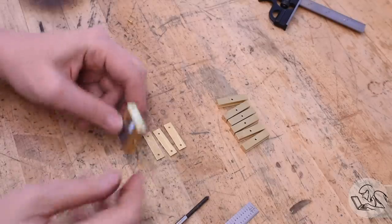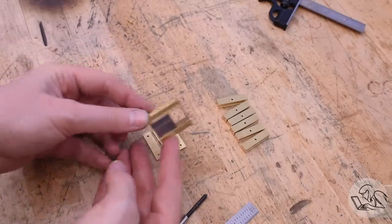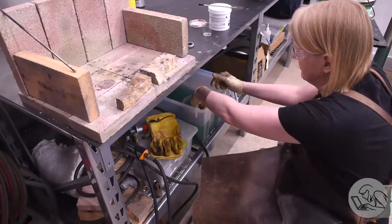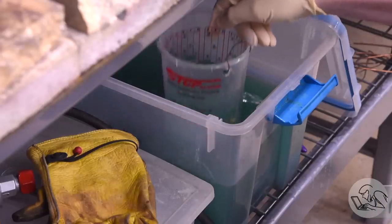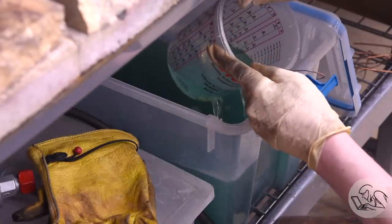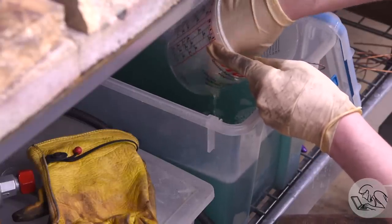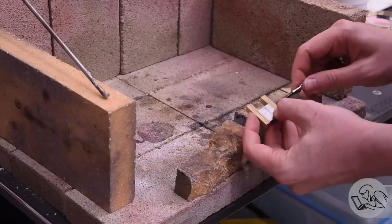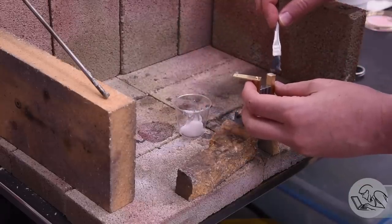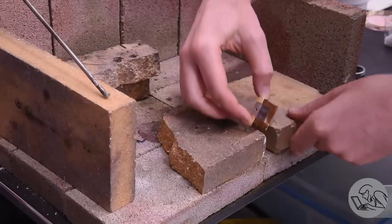Finally I can show how this all goes together: with the newly shortened screws and the little crossbar piece across the top, everything is attached to the fixturing block — and that is how it will be for silver soldering. Everything gets disassembled and dumped in the pickle bath for cleaning before soldering. I made a little strainer out of a chemical-resistant plastic bucket to pickle small parts in my big tub, so I don't have to have multiple pickling acid containers. The pieces then get attached to the fixturing block again, and I flux one joint while all pieces are attached with screws, so the entire assembly is held in its final position even though I'm only soldering one joint at a time.